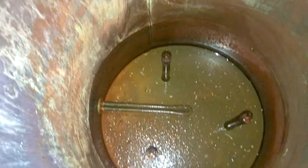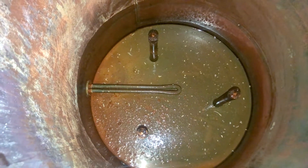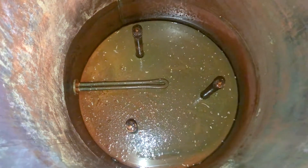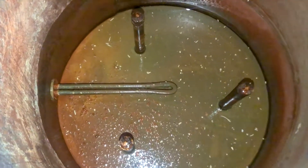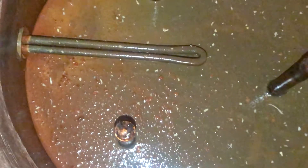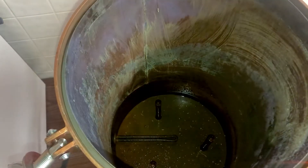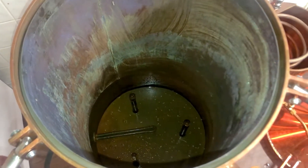So we'll take a look inside the still so you can see what's going on. This is the retort. You'll notice the horizontal tube sticking into the side of the distiller — that's the heating element. This is an electric distiller, a 220-volt distiller; we also have 110. You'll note there are some vertical standards, and what that does is it keeps the basket full of plant material from touching the water. You always want to have water covering your heating element, because if you don't, your heating element's going to burn out.